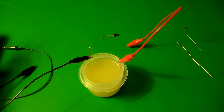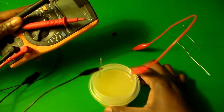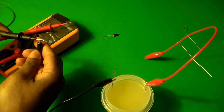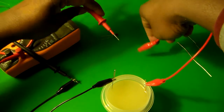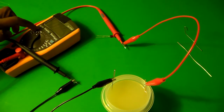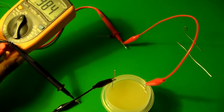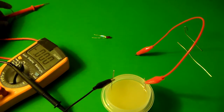Let's go ahead and see how much voltage we're actually getting from the lemon battery. To do that, I'm going to take the voltmeter and connect its probes to the terminals of my battery — black wire to common, and red wire to the positive terminal. I'll go ahead and turn this on.